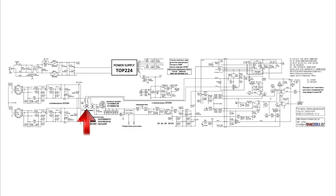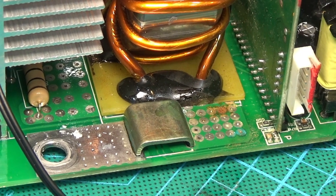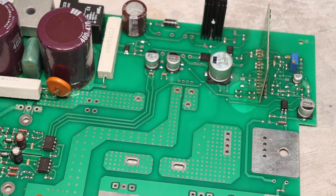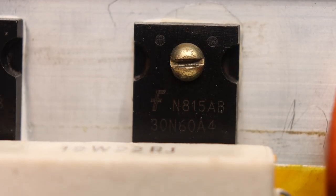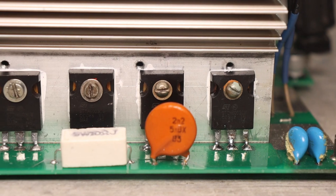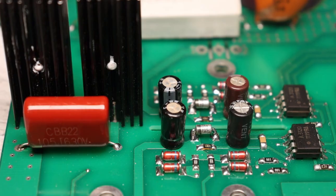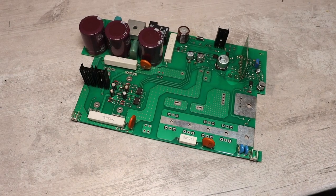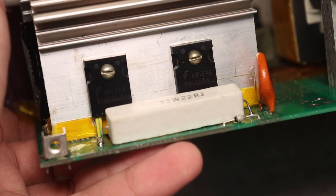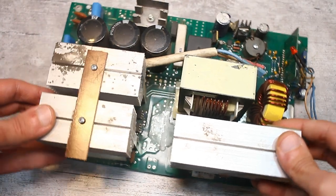Adjustment of the welding current is organized through a current transformer in the primary circuit. This method has the right to exist but doesn't allow you to control the current with high accuracy, as for example in the case of an output shunt. Also, this device does not have protection against short circuits — open circuits in the feedback circuit will most likely lead to the death of the inverter power transistors. The output rectifier is built on powerful diode assemblies with a common cathode. There are 7 seats on my board: 3 for direct diodes and 4 for closing ones. This topology has its own nuances and disadvantages — for example, poor performance due to reduced power supply, which is probably why there is protection against reduced mains. Among the disadvantages are high currents through switching transistors, hard switching mode and the possibility of remagnetization of the core, but in implementation forward converters are cheaper and simpler compared to the same bridge circuits.